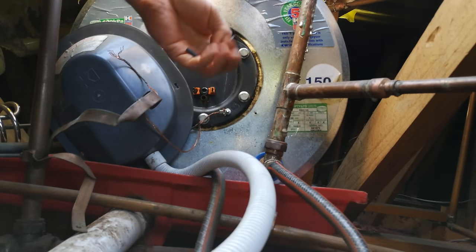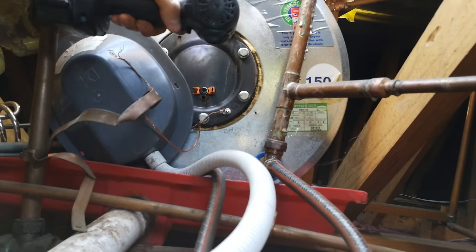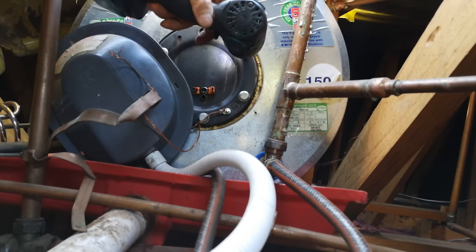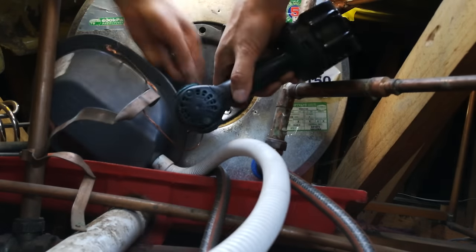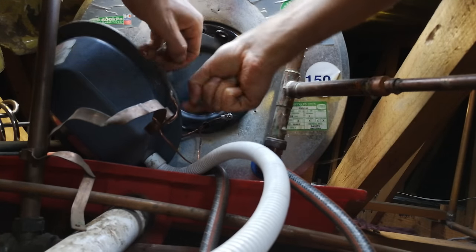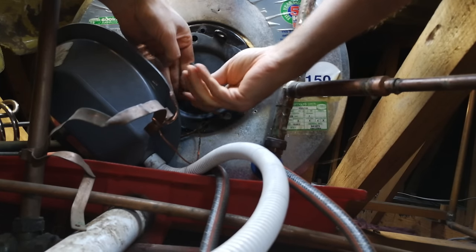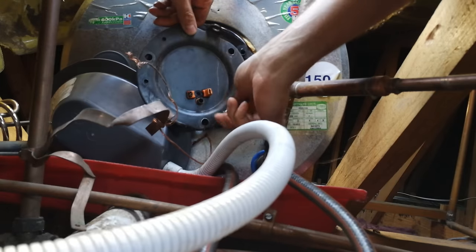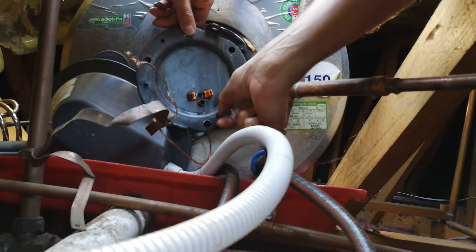It is still draining but I'm going to start loosening the bolts, which are size 13. I'll use a portable screwdriver to remove these. There's also a grub screw here which takes a size 5 allen key — I'm just releasing that so we can take the old element out and put the new one in. Keep that grub screw safe. For ease of maneuvering it might be a good idea to also release this earth braid — this copper wire — just so I can maneuver a bit.